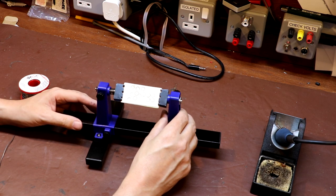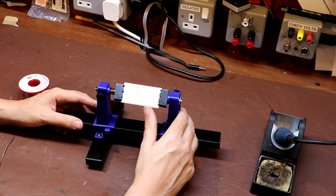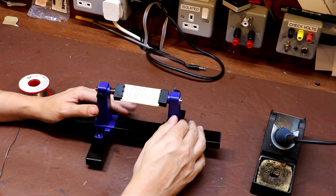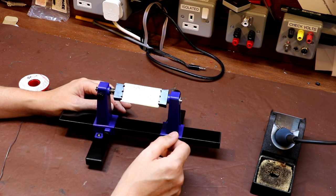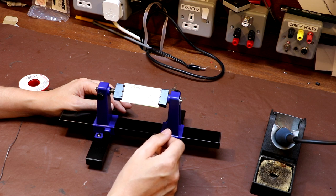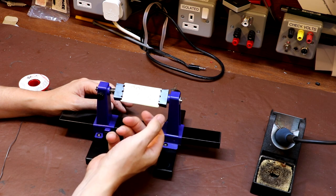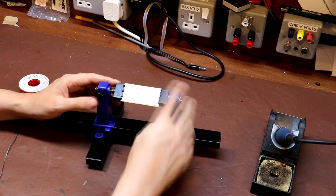I think these home assembly techniques are a little bit outdated now, especially with very cheap PCB manufacturing in China. If I send a board order to China I can actually get it back in the same week, and it costs almost as little as buying the bare board here in the UK. But of course the advantage is — much like today — I decided to build this on a Sunday morning and this technique just allows you to crack on. There's also dead bug style construction where you put all the components on their backs, which means you can look at the circuit diagram and get some synergy between what you've drawn and the components you're placing. I'm not really going to say one technique is better than the other — they're just different techniques.